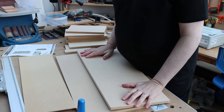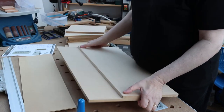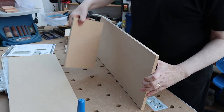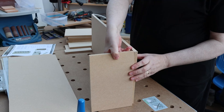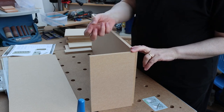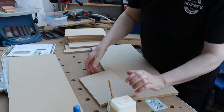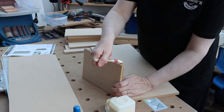So we have our two side panels, our shelves, and our toe kick. The next stage is to fix it all together and make our carcass. Take one of the shelves, find the best edge — that's going to be your fence edge — and we're going to do a simple butt joint. Glue them, and in my case I'm going to use some brad nails with an air gun to fix it together. You can use screws, nails, whatever you want. With MDF, because we're using wood glue, it really soaks in and forms a very strong joint, so the pins are just to hold it while it dries. I'm using standard wood glue — this is Titebond, if you're interested.